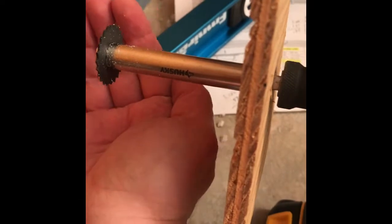Based on some advice online, we rigged up this setup with the cutting bit. I actually used an impact driver — the collet created a more flush, sturdy surface than the end of my drill. I took a piece of board, drilled a half-inch bit hole in it, and found that this gap is right around three inches. Then I did all my measurements from that point to figure out how far down below the grade I needed to cut.